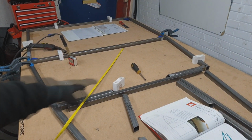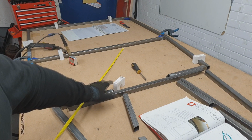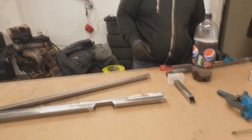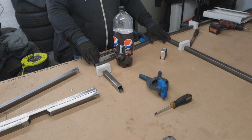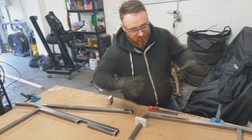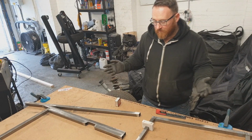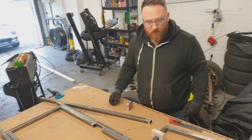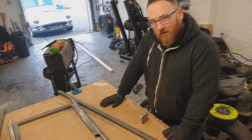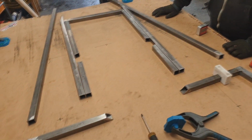Alright, so I take it back, you can't actually triangulate that by just running a big length of steel across the two of them and making sure it's straight. So we're at an interesting juncture here, whereby I'm running out of talent. Now if you have a look down here in the board, you'll see that I've just split the car in half, okay? Now all of this is fairly easy to work out. We've got a back here, a middle here, and a front here. Now as you can see, you can measure all of this and triangulate it and make sure it all measures and it's square. That's fine, and it has worked up until now because this is actually measuring perfect. The problem is from here forward, there's not a lot in the way of straight angles or edges for us to measure off of.